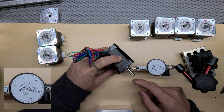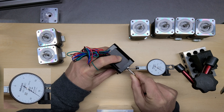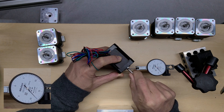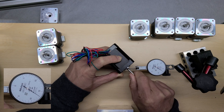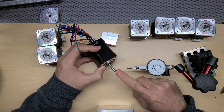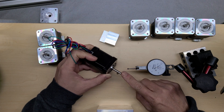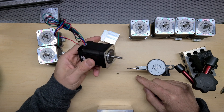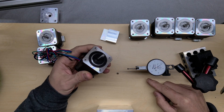I check at the bottom — that's my highest point. I keep the motor steady and spin it. Wow, look at that — it moves like 2 thousandths of an inch. If I use this motor in my 3D printer and put a pulley onto the shaft, I can see the pulley wobbling around the axle, which creates a really bad effect on your 3D printer's performance and print quality. So if a motor comes like that I wouldn't want to use it. This one is out of spec.